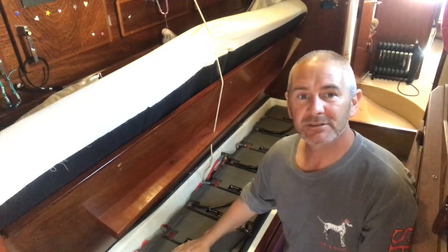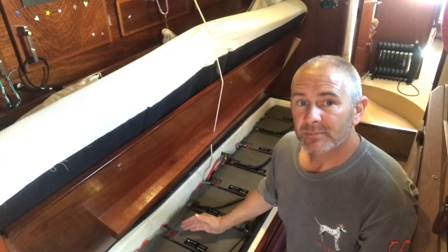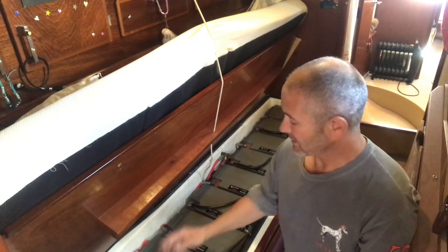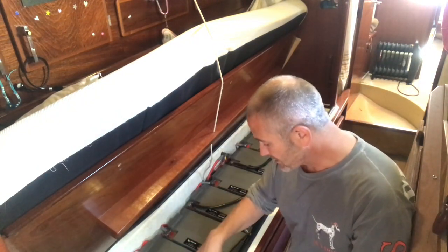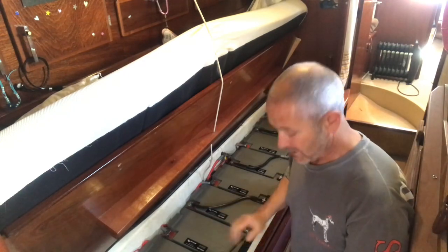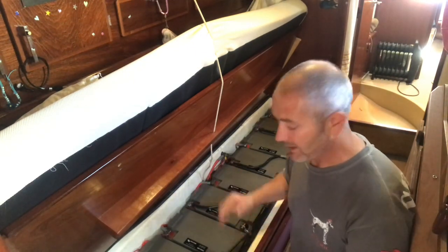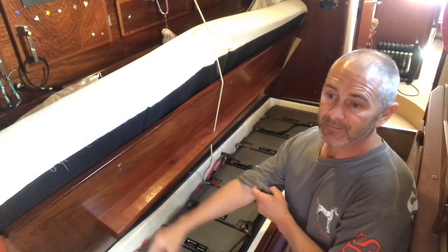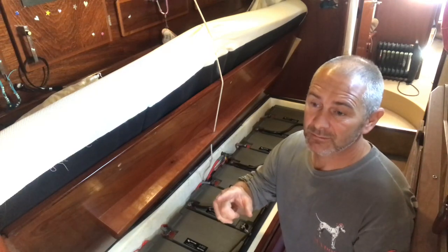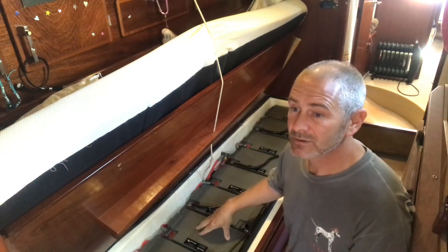Next day — we finished fairly late last night so I didn't get a chance to conclude the battery changeover, but we now have nine 110 amp hour Victron AGM batteries. It's not strictly necessary to have one for the engine battery but I wanted the extra just in case we needed to swap one out. We've got the positive terminal and the negative shunt, and it's so much neater — we can close the lid more easily. There are still a few gaps I'm going to pack out with foam noodle for cushioning. We've got the solar panels plugged in and tested and everything went like clockwork. Having a Victron battery monitor, Victron controller and Victron batteries means no compatibility issues. The solar is Panasonic, which has a fantastic reputation.